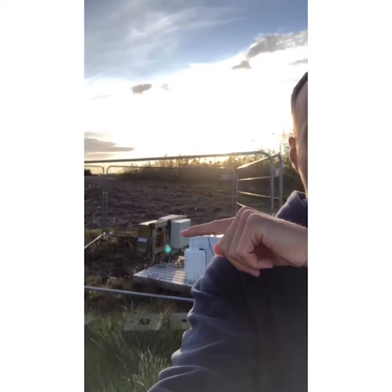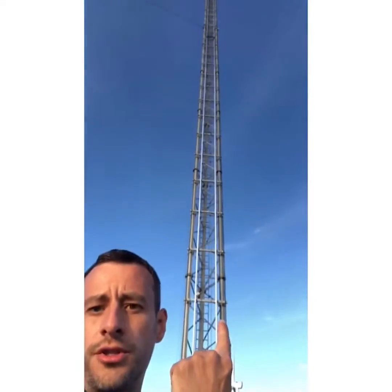So with that instrument, you're going to be able to measure the wind speed all across the rotor of the wind turbine, whereas with the meteorological mast, you're only measuring it at different points. So with the combination of the two of them, you actually have the full information of the wind field across the rotor. And then with the information of wind speed, wind direction, and so on, plus the power performance of the turbine, you're going to be able to measure the power curve of the turbine.